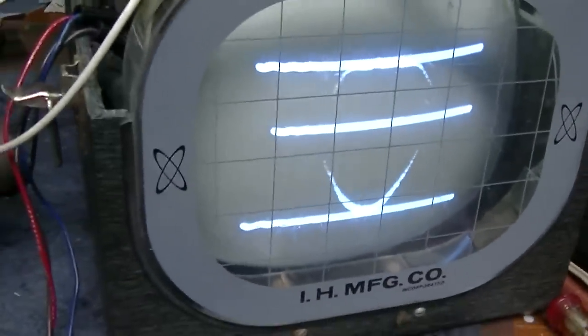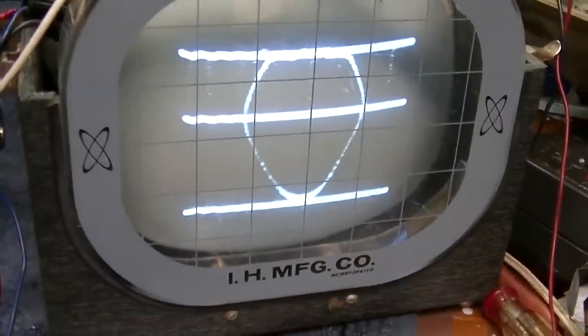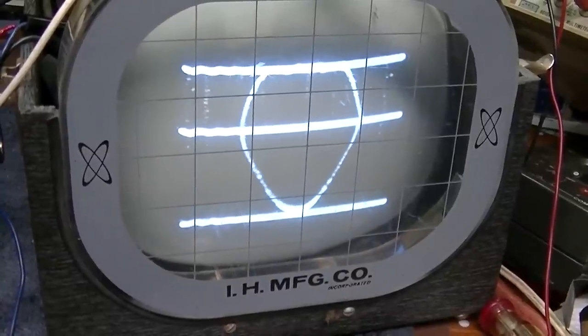So what do I do with this freaking tube? Clean these pins. Well, I sanded the pins and now it's rock solid. What a weird symptom of dirty pins, huh? Warms up after 30 seconds, it stops working, but now it's like overloaded with signal. Look at that. Wow. That's 500 microvolts, it starts to overload. Huh, what a difference.